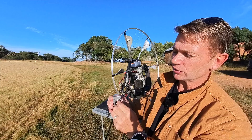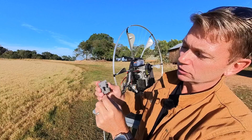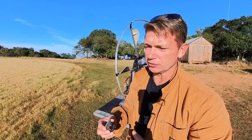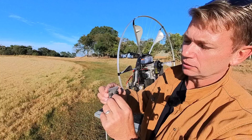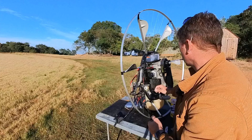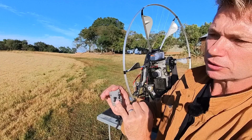The most common problem we're seeing with Walbro these days — it's not factory standard — but this is a carburetor plate I've had to fix. I fix these carburetor plates by punching the nipples out and reinstalling new ones. If this thing sucks air — if you can turn these nipples in any way — that most likely means you're sucking air in there. We actually delivered a brand new machine to a customer and the rough running was caused by this. We had to send a new top-end carburetor plate and once that was done, the issue was resolved.